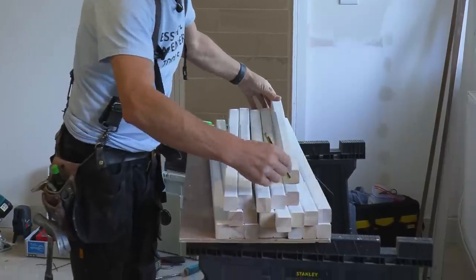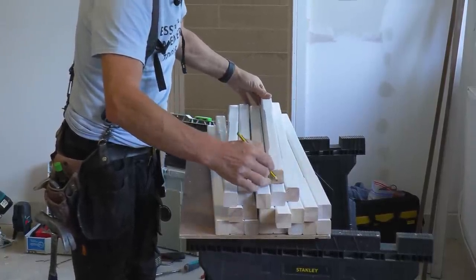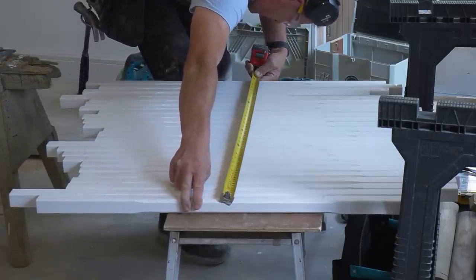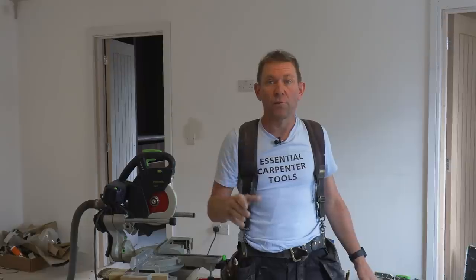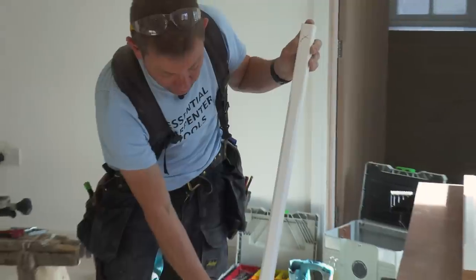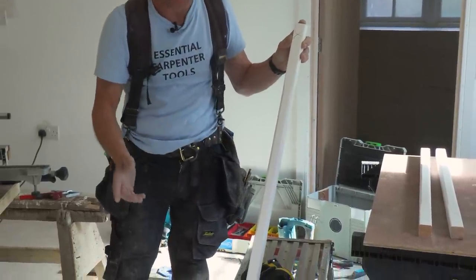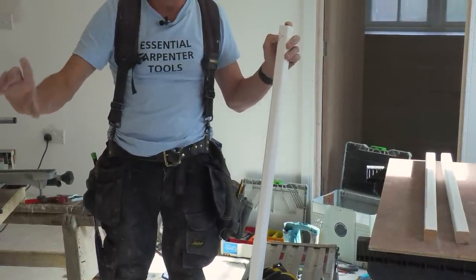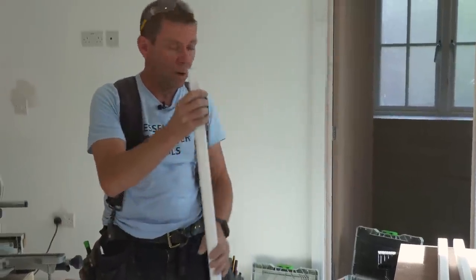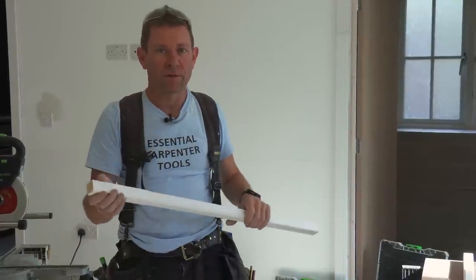If you're a little bit unsure, you can lay all the sticks out and physically measure them. I went 32.5mm by 25 — that gives us 812.5mm. If you knocked off half a mil off that, like 32mm times 25, you'd have been 25 blocks of half a mil out. So I always mark the tops of what I've just cut. As you can see, I've got a slightly bigger bit at the bottom than the top — it's just how I like it. Like the door, you've got a chunky bit at the bottom and a smaller piece at the top. So I always mark the tops as well because you don't want to get halfway through and get it upside down.